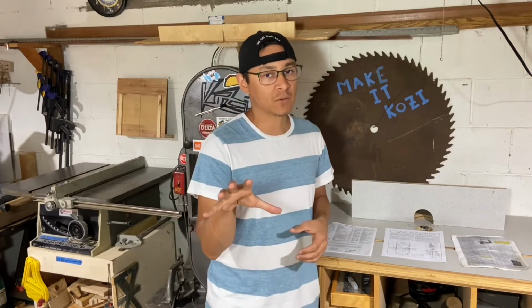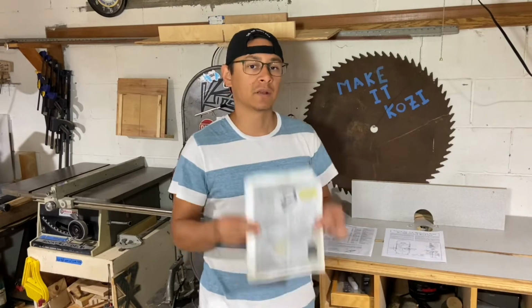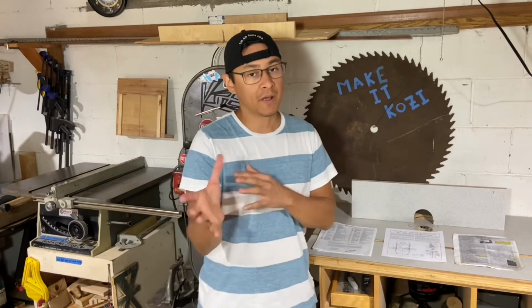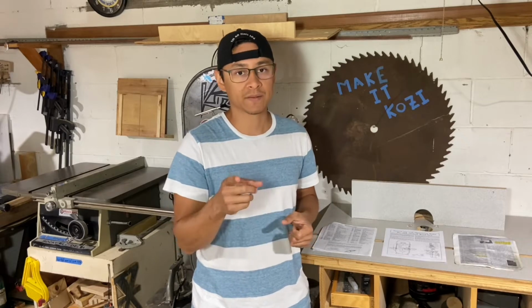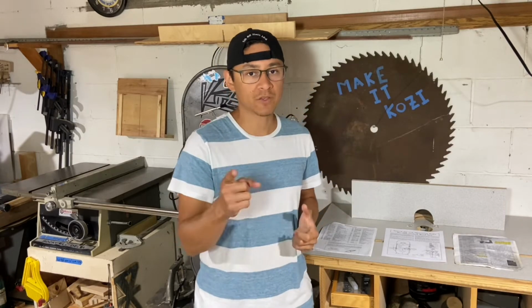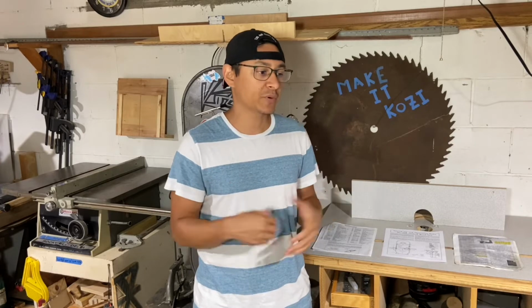Last thing that's nice about these old tech manuals is that when you're talking about old machines, you need proper lubrication. That's what's highlighted right here. I got the specific weight of oil that I need for my scroll saw for this example, but another thing that you might run into as far as an older machine goes are lubricating wicks. And different machines have different widths or diameters of the wick that you might need. So make sure that you give that a go as well in case you need to replace those. Those are pretty easily replaceable. That's just another example I'm giving here.